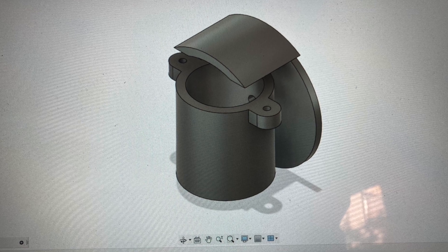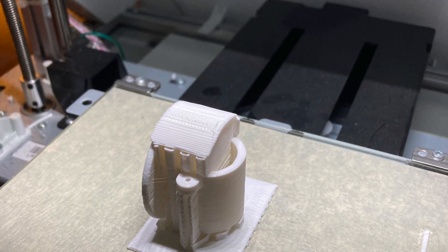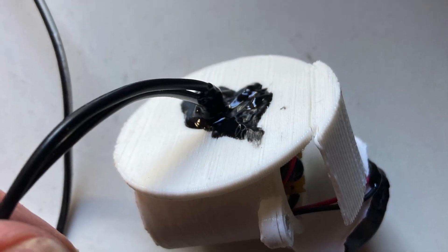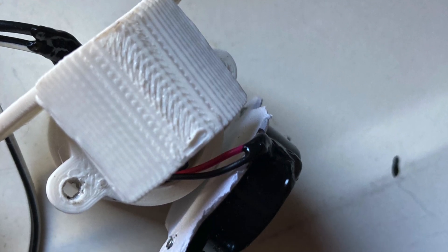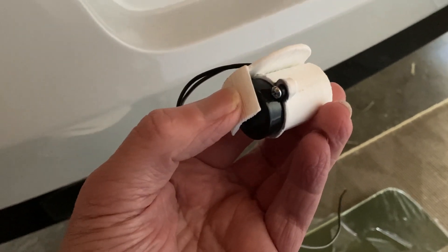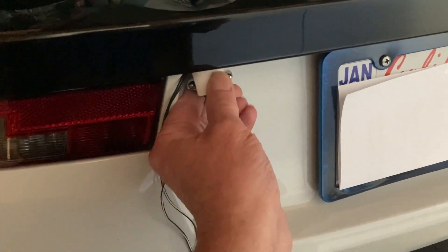For the case, I put together something from the 3D printer — designed something that's just trying to make a waterproof case with a little bit of a signal deflector as well, then printed it up on my 3D printer. With the electronics inside, I seal it up with some liquid tape to make sure there are no water leaks going inside, and a little rubber seal between the piezo buzzer and the internals.